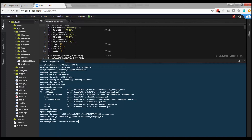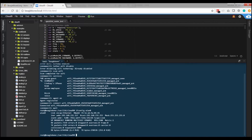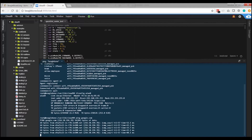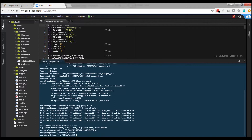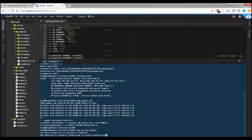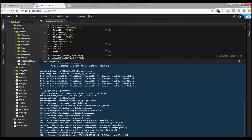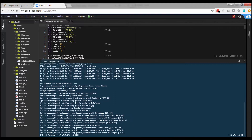You can test your Wi-Fi settings by using ifconfig and pinging something like google.com just to make sure you're actually getting wireless information. After a couple of pings, hit Ctrl+C to break that cycle and you're back in Bash. Once you see your root@BeagleBone again, go ahead and use sudo apt-get update and upgrade everything. This is going to take quite a while the first time you power up your board, but everything is changing so quickly that I really find it best to go ahead and update everything. What we really need for the next steps are the git package and the robotics cape package, but we really just want everything to be up to date.